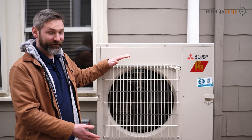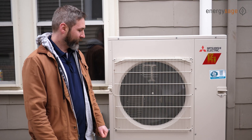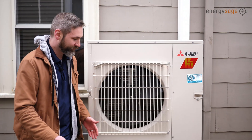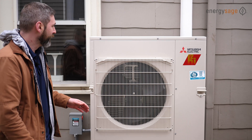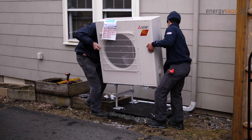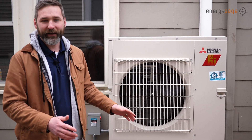Next, the outdoor units go in place. This is the part of the system that extracts warmth from outdoor air in winter and moves it inside, and blows warm air from the house outside in summer. It's a bit of an art where you place these things. This one is on an 18-inch stand because we're in Massachusetts and it snows — you want it above the snow line. You might still have to shovel it out, but mostly it should be fine on its own. Wayne also picked this spot because it's not blocking the window or the gate, it's out of everybody's sight line, and it's a good two feet from the neighbor's driveway, reducing the chance a snowplow or car will accidentally hit it.